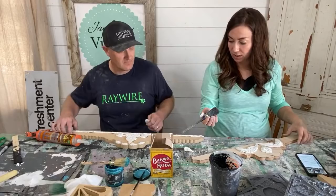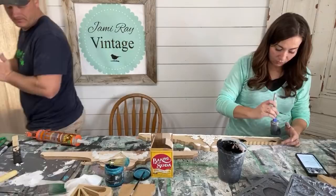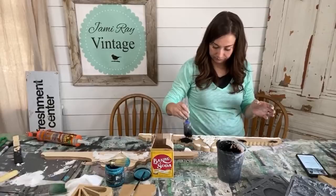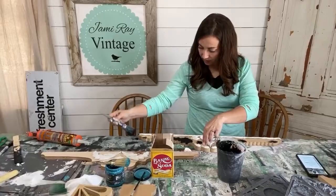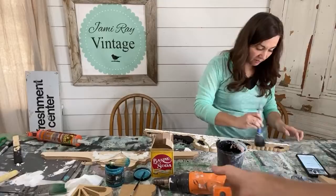Can I start salt washing this? We're going to need the heat gun out probably. I can't really salt wash the molded details because I'll totally mush them — that's okay. We don't even need full coverage with the salt wash; we'll just add some texture. The salt wash is all natural, but you do need to be careful when you mix it that you're not getting it up into your lungs because it is a powder — same with milk paint. Once it's mixed, it's fine.